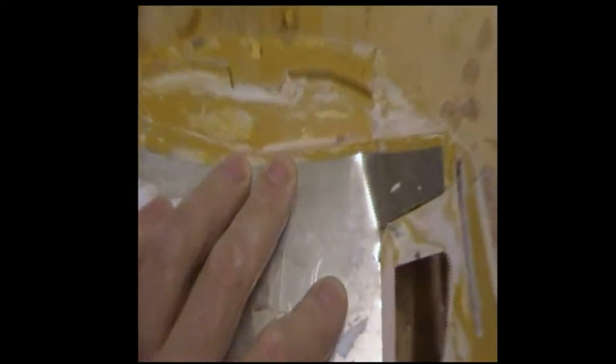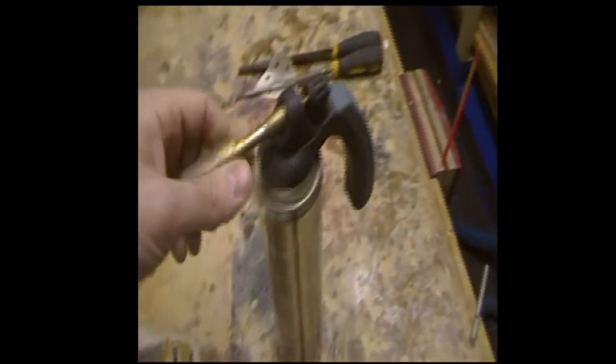Now on the back, after using the template, what I have done is I've got a very thin piece, 2mm, maybe 1.5, of aluminium, so it doesn't rust, and that's ready to go onto there for me to screw in. Again, it's not bending too well, so what I'll have to do is heat that up and anneal it just to shape it, and I'm going to do that by using the blowtorch onto there just to heat it up. So next stage is to heat it up.